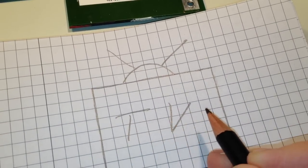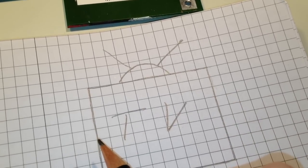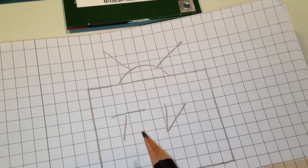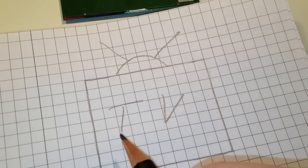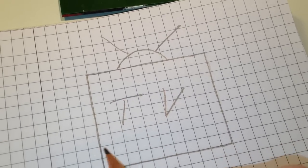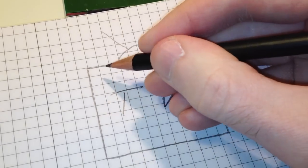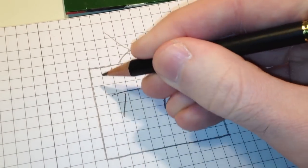Okay, goes like this, and bam, sync pulse. The logic pulser will again send a pulse for 10 microseconds. Maybe it stops here, and it continues like that on every line. Sync pulse here, and inject pulse here, and next line, inject, inject, inject, inject, and the result will be a vertical bar going across the screen like this.